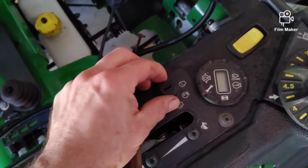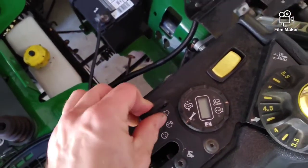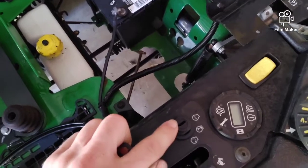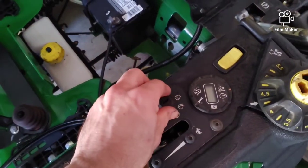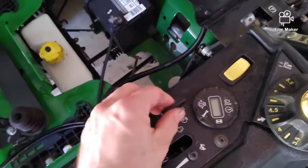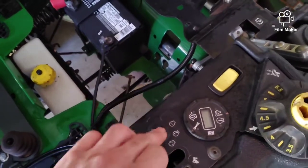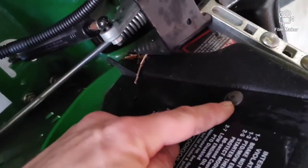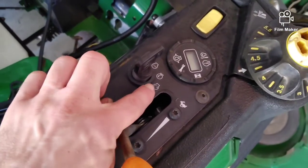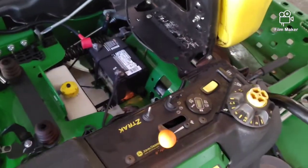Let me tell you about these key switches — it was a very common thing. Water: do not let water get down into this key switch. There were times where if they got rained on, even with the key in the off position, if water gets down in there it will try to start the unit — it'll send power to the starter and wear it out. I'd recommend getting the type of key that has a boot over it. They're really easy to change: take this Torx bolt, this 10mm bolt, and another Torx bit here, take off the panel and remove the key switch. It's a very DIY type of repair.